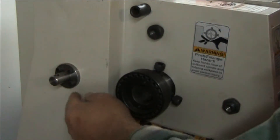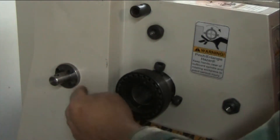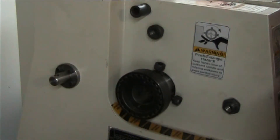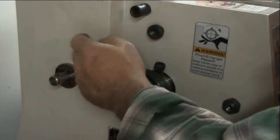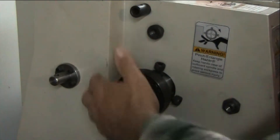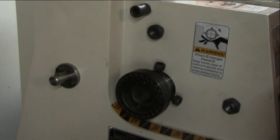The lug is just a pin rounded off with a through hole — you'll see when I assemble it how that works. It's not very precision; it's got four bolts around it, through-bolted with lock washers and nuts on the back. I believe it was a little too thin to tap, which is why I went that route. There's plenty of clearance back there with the change gears, so no further modifications were needed. This way the handle assembly comes off horizontally and I can use it more effectively. Let's take a look at what it's going to take to machine the draw tube and then we'll show you the whole thing put together.